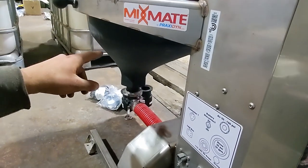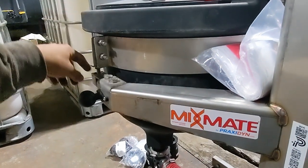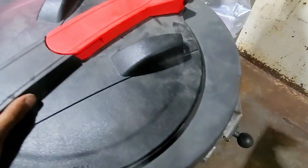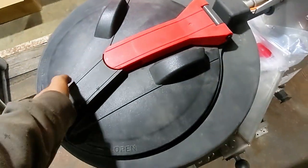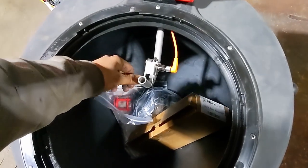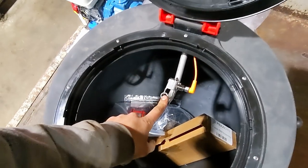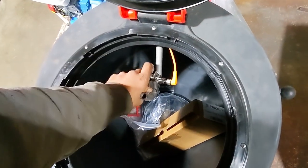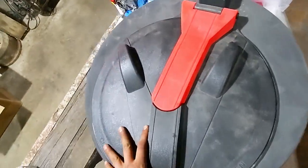There's an inductor that comes in the middle that goes by weight, load cells right here. Rinse is right there to rinse the inductor. This thing's got a jug rinse in here. So you push the jug on there, proximity sensor starts sending rinse water and air out of here, and then you can empty 2.5 gallon jugs in, I don't know, a couple seconds, 2 seconds, 3 seconds, something like that.